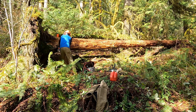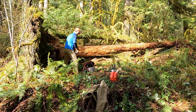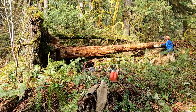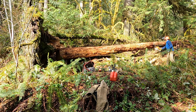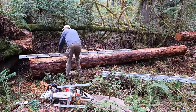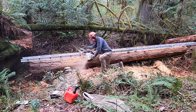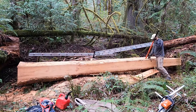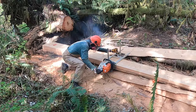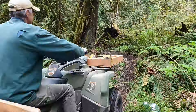On to the next log. To build this pavilion I need two 20-foot 3x10s, two 14-foot 3x10s, two 14-foot 2x10s, a 12-foot 2x8 ridge beam, four 9-foot 2x6 gable beams, a pile of 2x4s for rafters and a bigger pile of 1x4s for roof decking, and last, four posts 7x7 that are 10 feet tall.